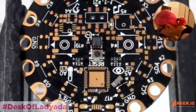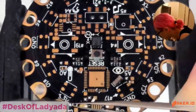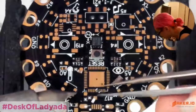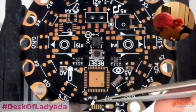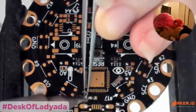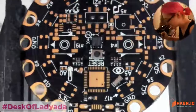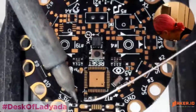Okay. Soldering 0603s. Any other questions while I'm waiting for my hands? Okay. Oh, these actually do have very small markings on them. These, the 22 ohms, but the 1Ks don't. That is actually another thing I've noticed. Sometimes when you get resistors, they have markings on them, and some companies no longer mark. So I personally will pay, it's only like a hundredth of a cent more, to get ones with markings, because it makes it easier when you're in production.